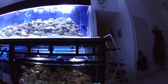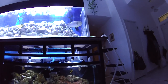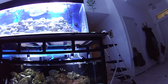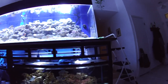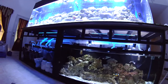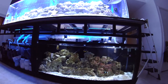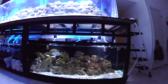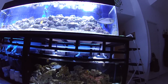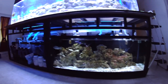The overflow box gravity feeds the tank down below. There's a ball valve there to help control it. Wide open, the ball valve is dumping into the tank — I'm guessing 500 gallons per hour. What that ball valve can't take of the overflow travels down the drain tube into another one, which dumps the remainder back behind those rocks. I've plugged one of the drains to see if the other drain will take it, and it almost does — just shy of handling the load wide open. So normally I have them closed just a little bit, but this has been running for over a year this way without any troubles whatsoever.